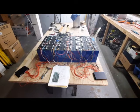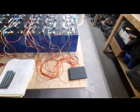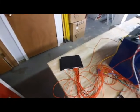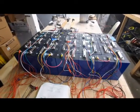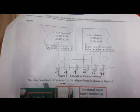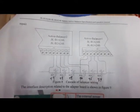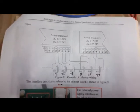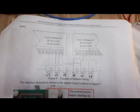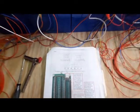This is a quick video on connecting active balancers in cascade. This is a 30-battery group, and I have two 16S JK active balancers — there's one there, and there's one there, and they're working well. I'm not going to get into active balancers generally; this is strictly about cascading them. Per the instructions, B- and B-1 of active balancer 2 are laid directly across the last battery of active balancer 1, so they will communicate — one will see that the other has a low battery. They're only talking through that last battery, and I say talking because this is not a digital thing — it's just seeing the low or high voltage.